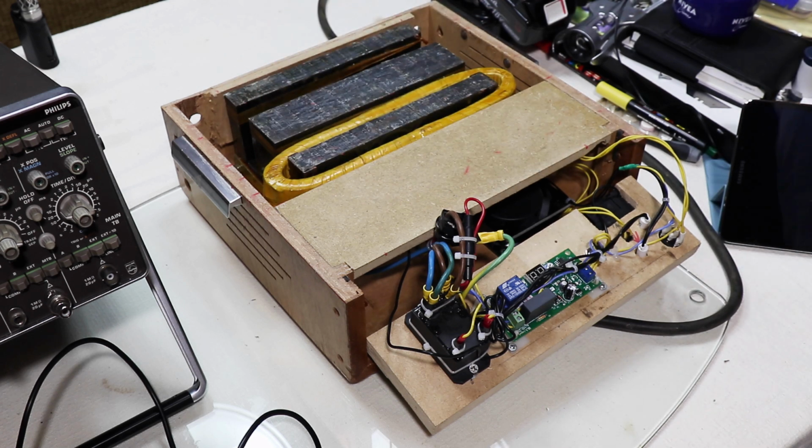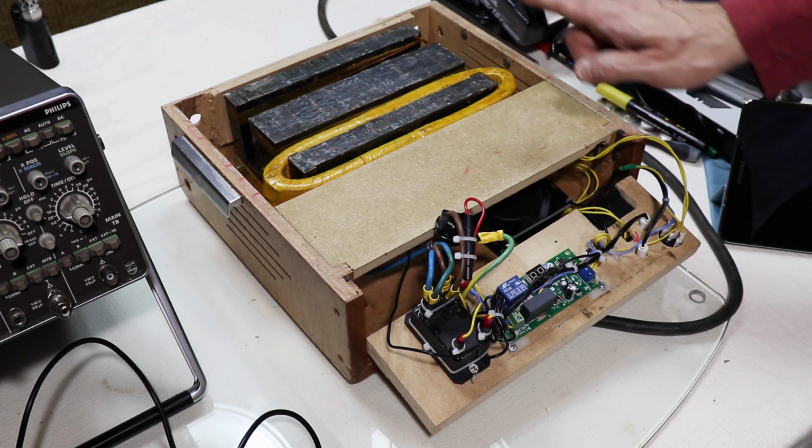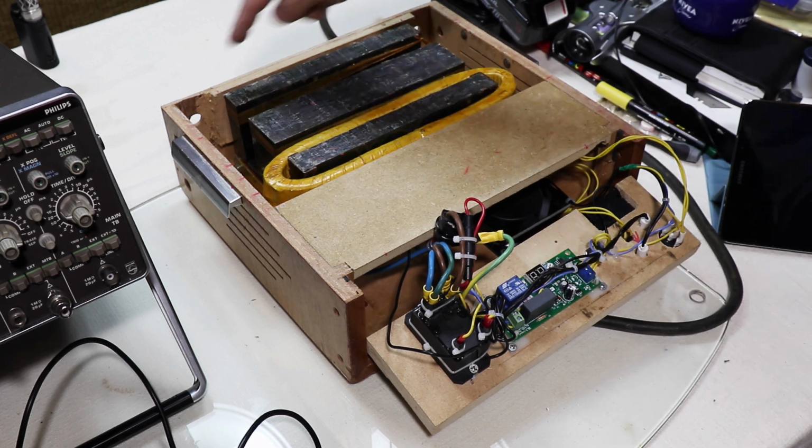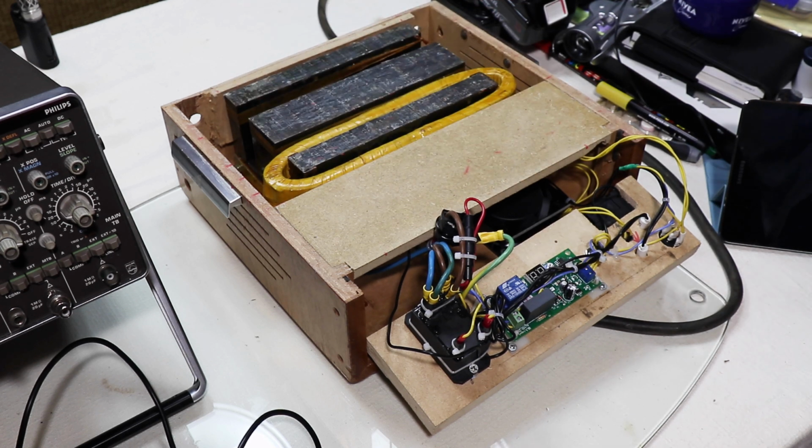And I'm wishing now that I'd not fitted this quite so far back in this housing, because if I'd left myself a bit more room, I could get some really stout cable, really thick cable, or pipe even, my brother-in-law suggested, around there, and have, like, I don't know, a 2, 4, 5 turn secondary, and have some fun with very low voltage but very high current. Use it for, you know, melting things. I mean, there is room to get something narrow down there, but I think it'll get too hot. So maybe another day I'll modify it again and bring that magnet, or that yoke, a little bit forward.